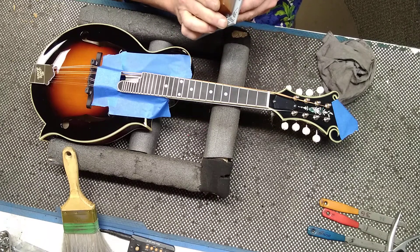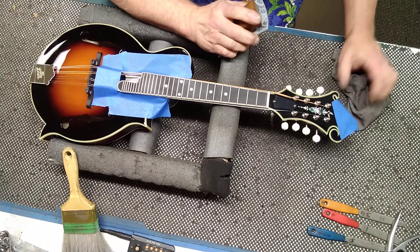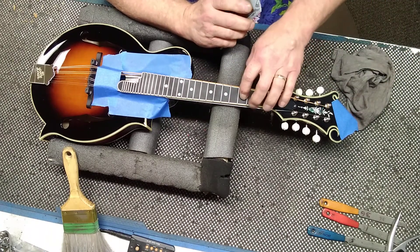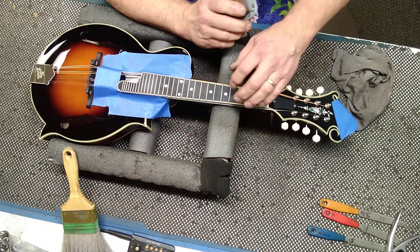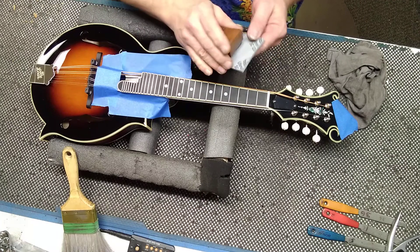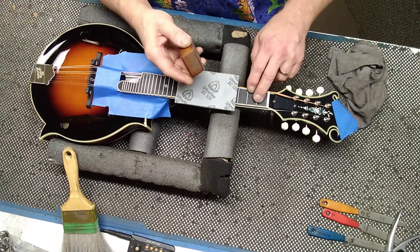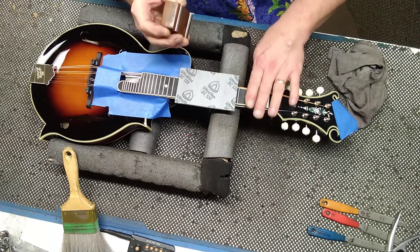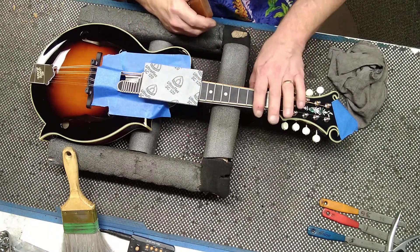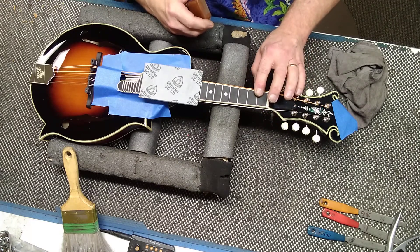There's no way that files are the fastest or the easiest because files take skill and they take time. They are also taping off their fretboard. This block also sands the fretboard very nicely — it's inlay safe. Steel rods down, 120 grit. This is perfect for mandolins because it's nice and flat with a flat fretboard. No matter how good you are with a file, you're still going to radius the ends of the frets on a mandolin.